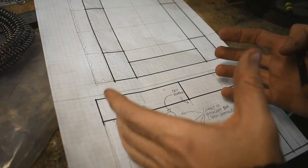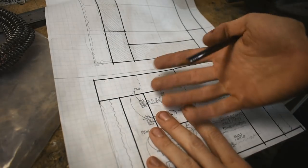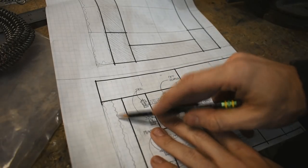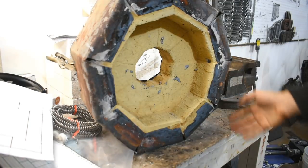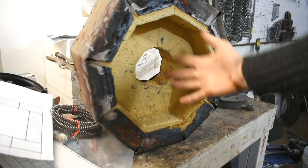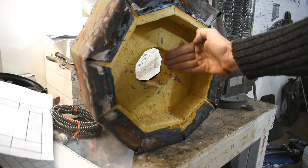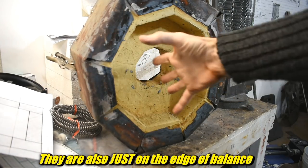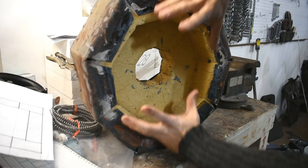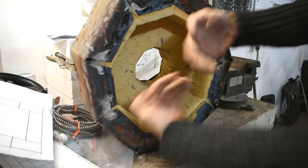Secondly, I'm going to put a steel enclosure around it, and around the whole thing, because you don't want exposed ceramic wool. Despite what you may have seen on YouTube, that crap is bad to breathe in. So cover it up. And here is proof of concept of the steel enclosure actually working. Now these fire bricks, this is my foundry furnace lid, these bricks are hanging over the edge. They might want to tip down as well, but this steel has been holding it in. It's not squeezing in around the edges, but it's not going to let any of them back up and want to tip out.